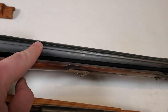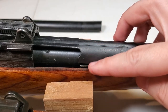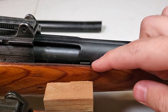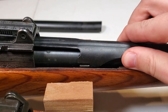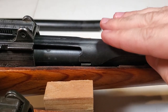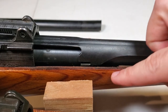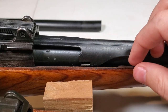This is the op rod — it's a really long flat piece of metal. You can see how the op rod interacts with the return spring: there's just this little nub sticking out on either side, and a little extension off the op rod that just connects to it and returns the op rod to its original position after firing. I'm guessing there was no really good way of adding a return spring without it sitting up too high, so what they did was put it in the stock underneath. Later on I'll take the stock off and show you what that looks like.